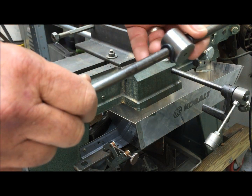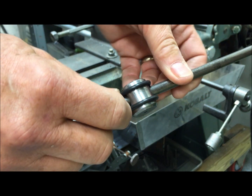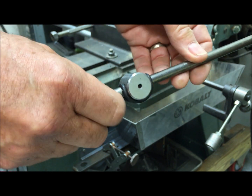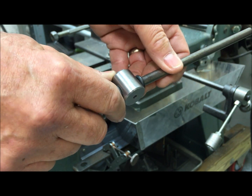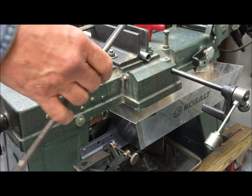Not much to it. Clearly this doesn't move because there's friction between the O-ring and the cylinder. The cylinder is clean and dry — I can't afford to have oil on there. One thing about friction is it's very sensitive to vibration: the more vibration, the more the friction is reduced. So I use that to my advantage.